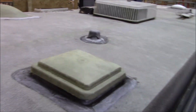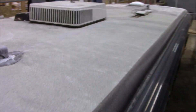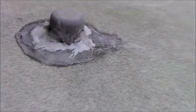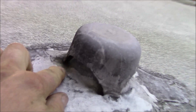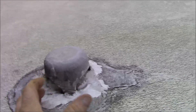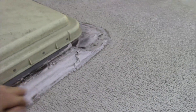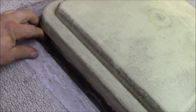We want to see what's going on underneath all this mess as much as we can. And by the way, this is not sponsored by Dicor. Look at that gap in there — how are you going to get product properly mashed in there? When water gets in there, there's a screw right here — that's how this leaks. I don't like these bell housings. When we put our boot on here there's no way you can leak, but you can tell someone already tried to pile up Dicor caulking — just making a moat of it.